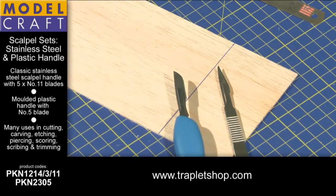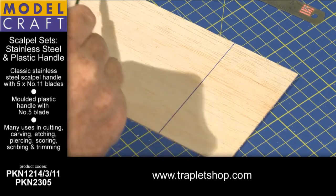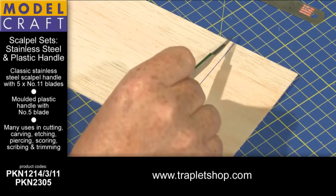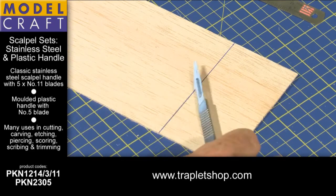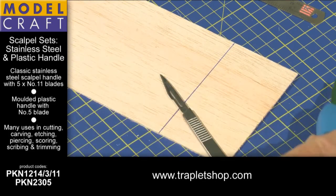There are a couple of tips for cutting balsa that are really useful. Notice the grain on the balsa runs this way — you can see that by the long brown streaks — and if we want to cut across the grain we should always use the pointed knife. The more rounded one is useful for cutting along the grain, as we'll see in a moment.